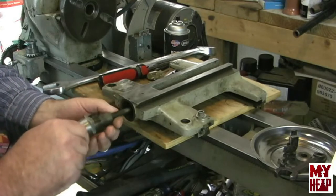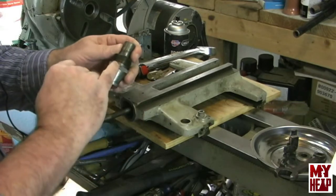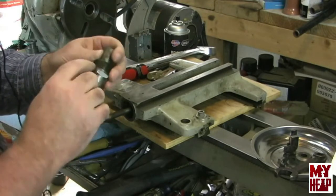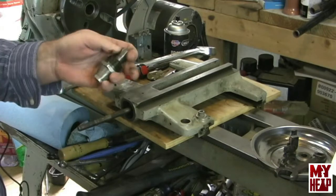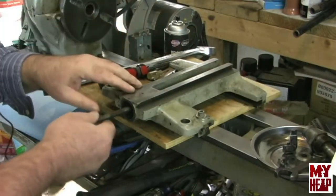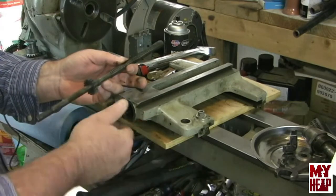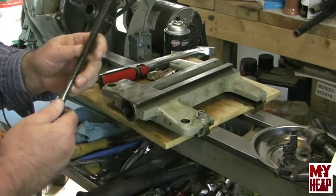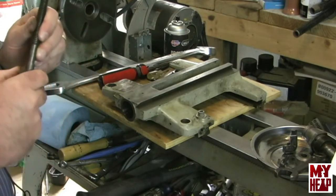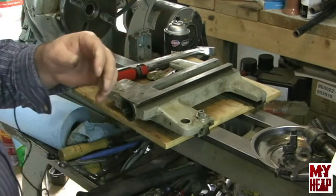This will unthread and come off the screw. Someone pointed out there's a little hole here — when this is lined up with the mark, that little hole should be lined up with the oil hole so that you can get oil on the screw. So the screw assembly comes out at that point. You could have actually left the handle and everything on, just unscrewed it and pulled everything out. The gear, I believe, is held on — it looks like there's a Woodruff key there — so you could take this whole assembly apart, but that's as far as I'm going to go with it.